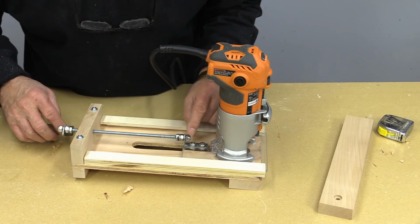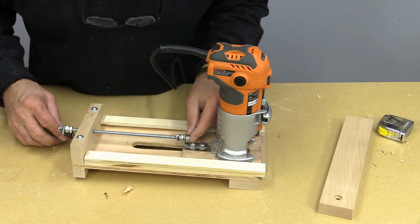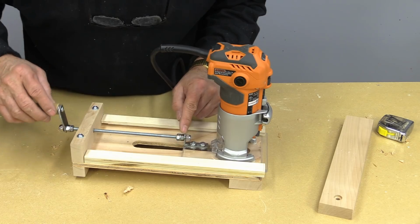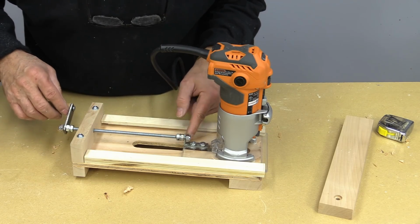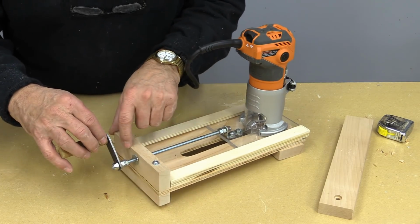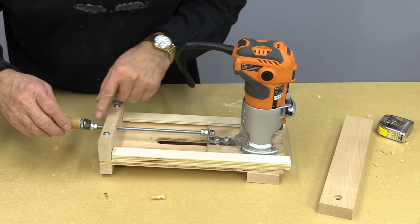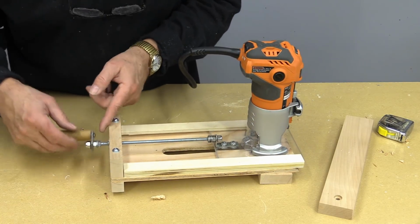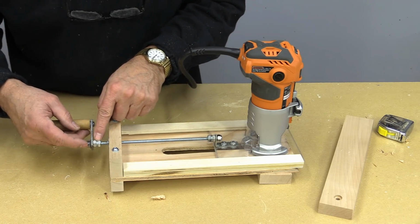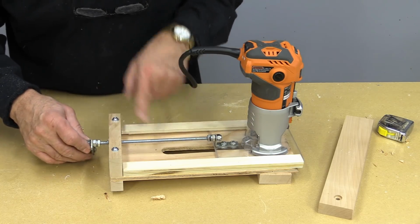So this is one of those self-locking nuts, and I've got 2 nuts that are locked together. So see how this area spins like this? It spins free between the L bracket down here, and then of course on this side I have the T-nut, and it's locked to this backing plate. Then this is just a handle that I took off another project because I didn't want to take time to make one right now, because I wanted to see if this thing works. So it's just locked to the ready rod now.